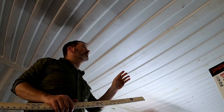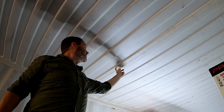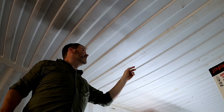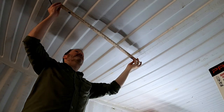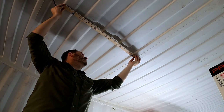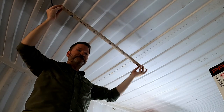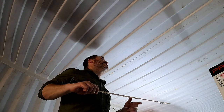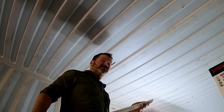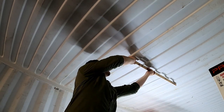One thing I really want to point out is every three feet there is a seam, and that seam creates a bit of an issue. It's still easy enough, especially if you're doing each light at a time, to just mark that you need to be moved over slightly from that seam. Also, these magnets are super strong and they're going to want to grab and slap. They can crack — they can actually shatter — so be careful, though there's no getting around it to some degree.